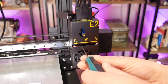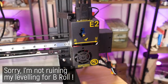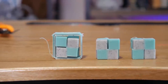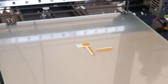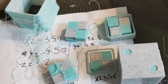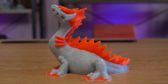To calibrate height, you need to loosen a screw on extruder 2 and shove a thin wrench into a slot, which is a little bit awkward but not too bad. Despite the small range of movement, the thread is actually fairly coarse, so it takes a little bit of practice to nail. Both extruders key into a really nicely machined aluminium block, but you'll need to do this again if you ever replace the nozzle or service them. Once you've aligned them in Z, you also need to do the same for X and Y so that your dual color prints line up correctly. I threw a rectangle model together to show me how far the nozzles were misaligned, then look at the finished print, take the amount they're misaligned by, and change the X2 and Y2 offsets to compensate. Be warned — this process is basically a ton of trial and error, and if you change extruder 2's nozzle height, you'll have to go through this process all over again. Take your time, get it right in sequence, because the prints are worth the effort.